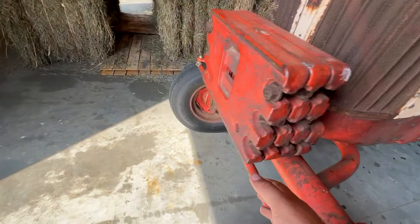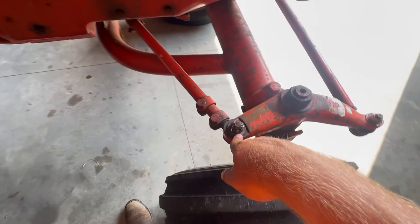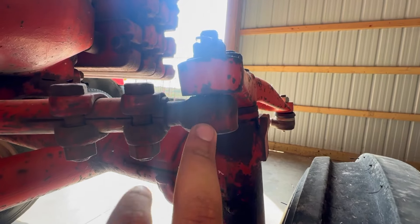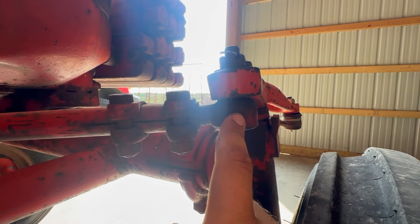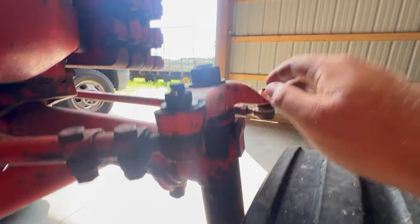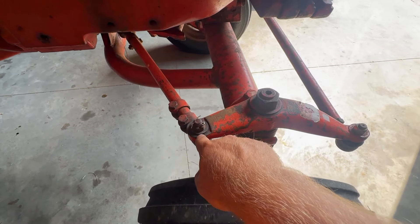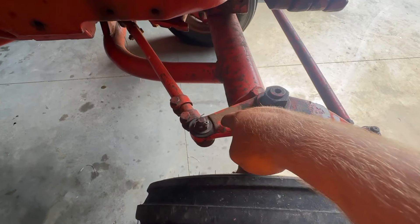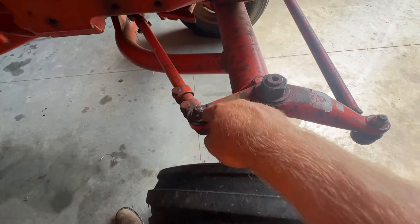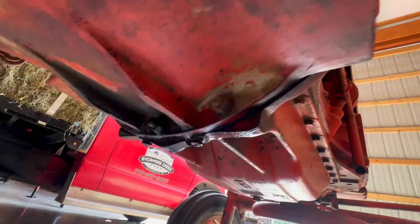The Case here has a very similar issue where these tires wobble a lot, but it's only because of this — the tire out here is worn out. I tried to replace it by taking the bolts out and pulling it off but the whole thing is just seized, and I probably need a new one. It's a simpler steering mechanism and it wobbles just because there's not enough tightness in here, so we stuff pieces of metal down in there every now and again to try to keep it tight. Also pretty sure the rear main seal on this tractor is going out.